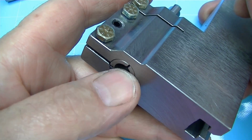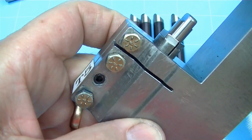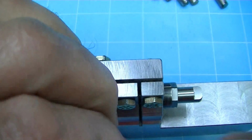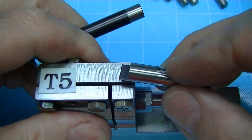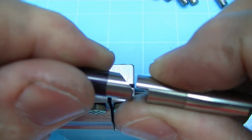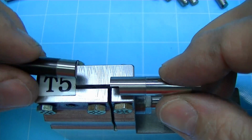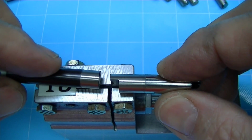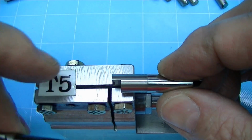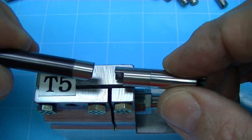This bushing is eccentric, has a hex on the back so that you can adjust center height by rotating the bushing. But this has a special bushing where the bushing is split, and in the back half here I'm holding a piece like this that interfaces like this with the part, so it's doing the end control. So this allows me to position this, rotary position it, get this tweaked into where I want the tool level and axial position, and then this doesn't get loosened, this stays put the whole time. But I loosen these, which are actually clamping the tool each time.